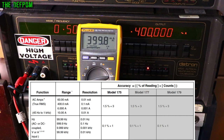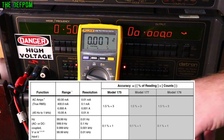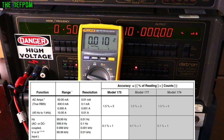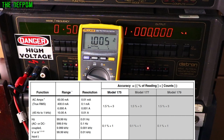AC amps at 500 Hz: there's a ghost current of a couple of counts on the AC range — not going to worry about the microamp range. 10 milliamps showed up after a little while settling. 100 milliamps — perfect. 1 amp — 5 counts out, well within spec. 1.906 amps — 6 counts out, still well within spec.